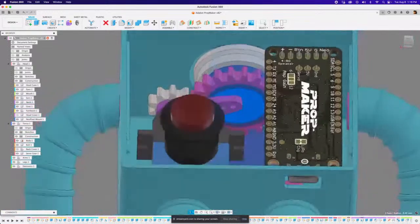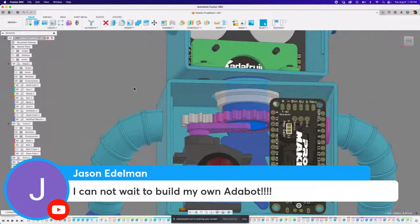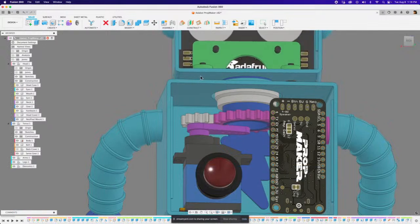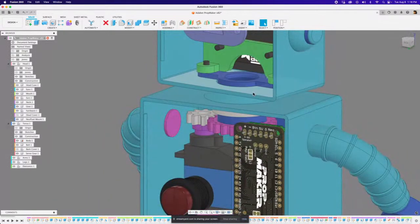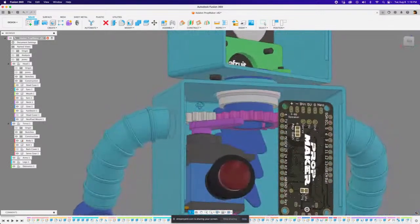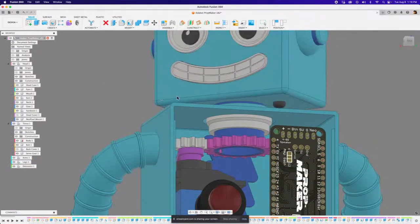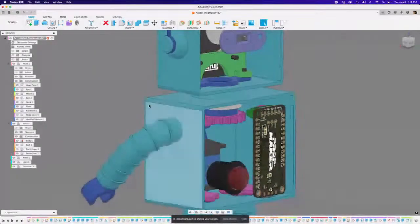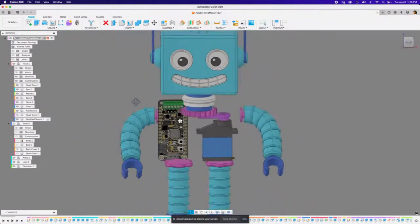You can see here in the neck that's where all the wires for the NeoPixel, the speaker, and the slide switch kind of pass through. Some folks ask why didn't you use a slip ring — that's one of those things you'd use for something like this. But because it's so simple and I'm only getting about 180 degrees of movement, it really wasn't necessary. A slip ring is more something you need if your thing is continuously rotating — like if we had a poltergeist Adabot here just kept spinning around and around. Maybe for Halloween. Then you'd have to reckon with the slip rings.